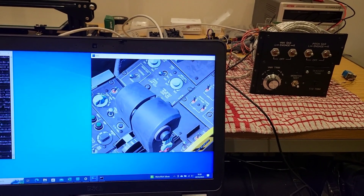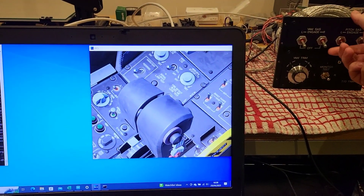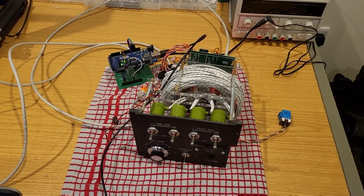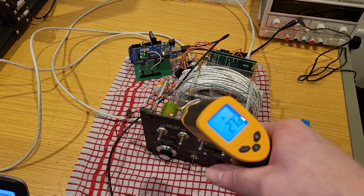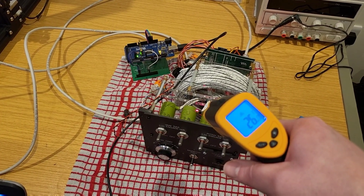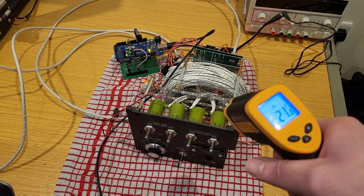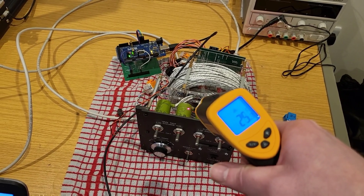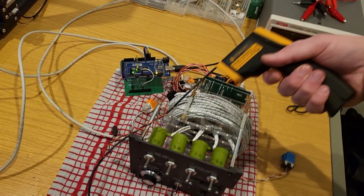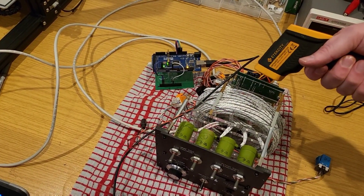I've run a number of tests in terms of the voltages applied, the force of actuation, the amount of current draw in use, and also the effect of the coil being energized for a period of time and the temperature through that passage of time. After 15 to 20 minutes of them being in use, the temperature didn't seem in any tests to get any greater beyond that point — it tops out around about 27 to 28 degrees. When completed and back in place, this panel will be interesting from the point of view of how it's interfaced, as the new switches are through DCS BIOS over an RS485 network.